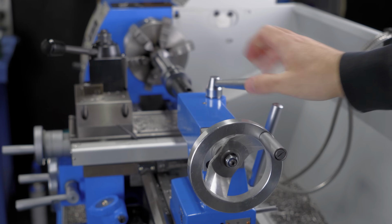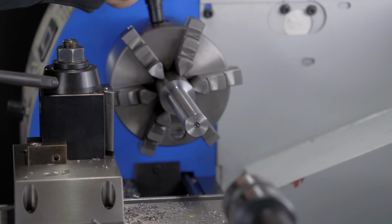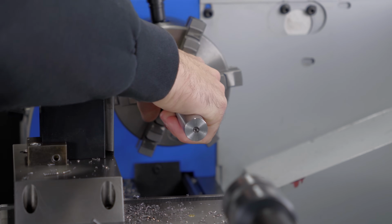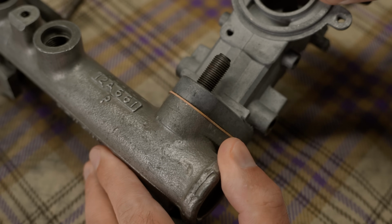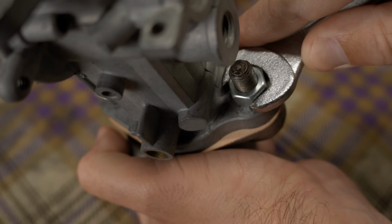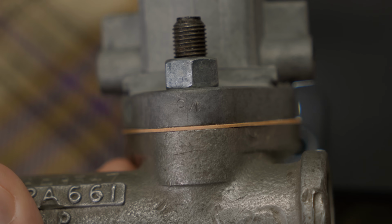So if I don't address the two problems, the flanges, which have deformed over time, and the worn out bushings, I'll probably have vacuum leaks. A vacuum leak in the intake system is a problem, because more air mixed with the same amount of fuel is the recipe to run lean. An engine running lean is one that can overheat and have running issues like a rough idle.